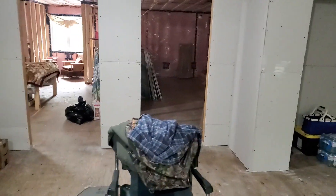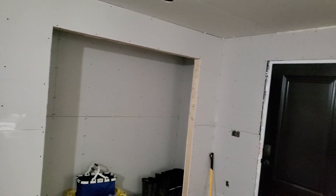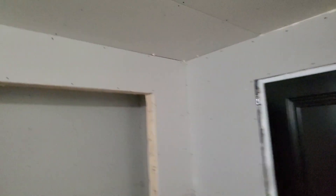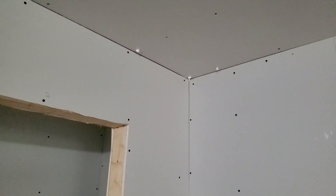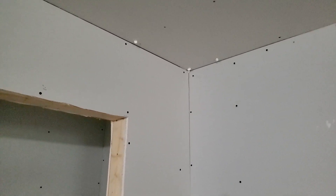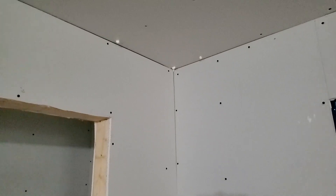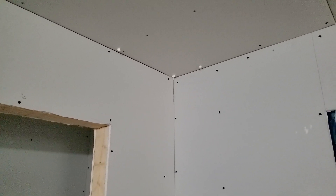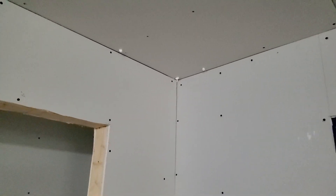There are a few things here where I had to do a little cheat. I did a lot of leveling and I thought I got it all leveled, but I missed the corner. I didn't level this properly. What I ended up doing is drilling three holes to level it — because it was up and there's a big gap there. All I did is spray foam it, and it pushed on the strapping and pushed it down, hard as a rock. I let it dry for 48 hours and then I'm going to go up there and put three more screws in, a little bit longer. I already kind of beveled it so the screws will sit in. That's how I leveled it — just spray foam.